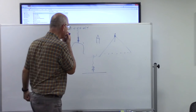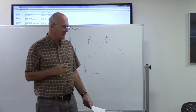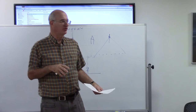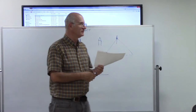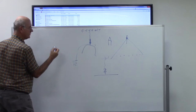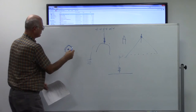The best way of connecting the station ground is to use braided wire. Braided wire has some unique properties that will dissipate the charge as opposed to being concentrated and melting the wire away from the strike. An example of braided wire would be your coax cable: you've got your solid center, and then you've got your braided shield that's around that. Well, that's a braided wire.